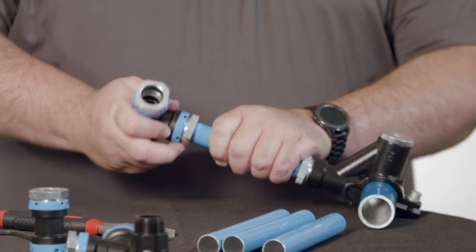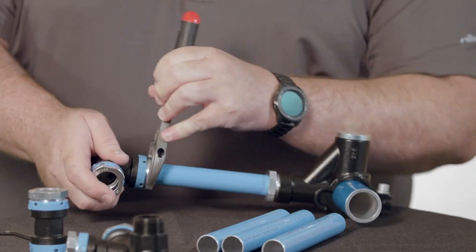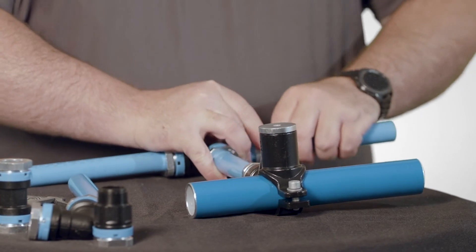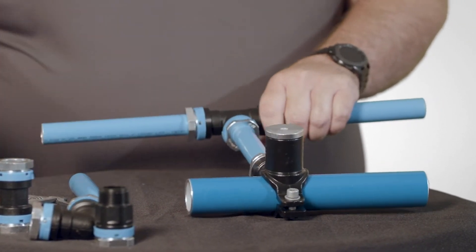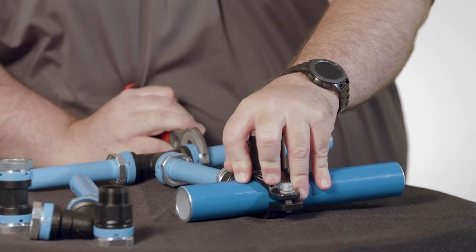Now take the equal T and insert it into the pipe on the branch side of the T. Next, take a couple pieces of your 20mm pipe and insert one into each side of the T. Tighten and secure both of those nuts. You do have the option of lubricating the pipe being inserted into the fittings — this makes it easier to slide in and seat firmly, and is best done with a simple soap and water mixture. The clamping pressure of the fitting creates a very strong connection that is practically impossible to separate.